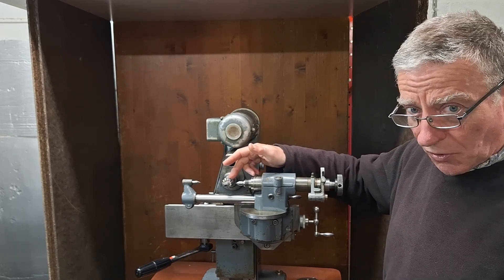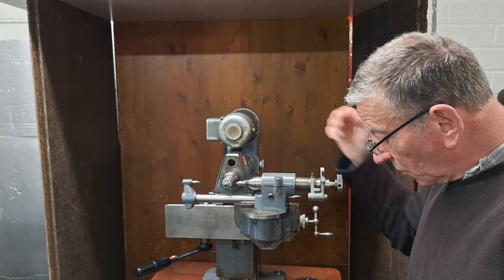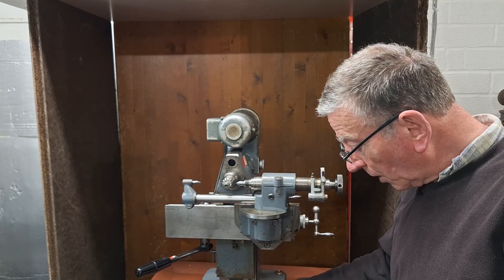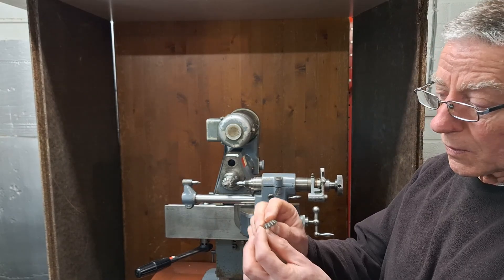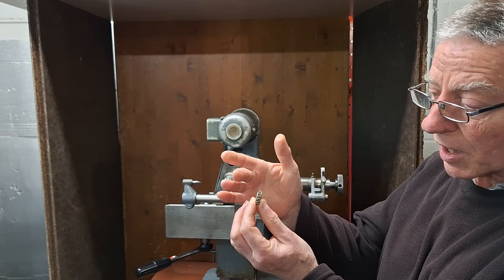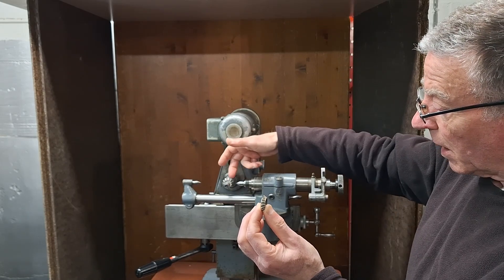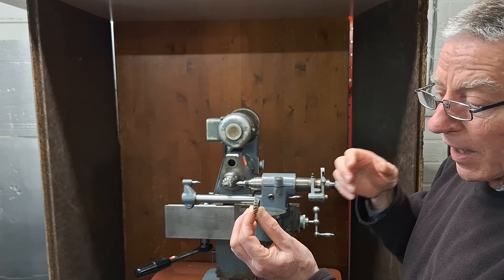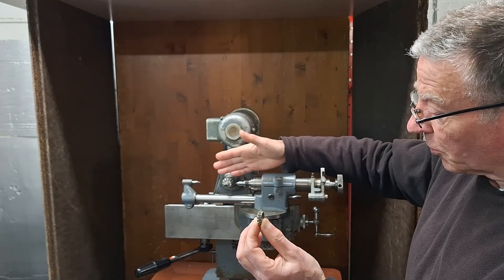The cutter I'm using in this instance is a 60 degree ratchet cutter, which is not a symmetrical cutter. It's a 60 degree ratchet wheel cutter with a rear flat flank disposed at the rear, and that's going to be the line of what I'm trying to achieve on centre.